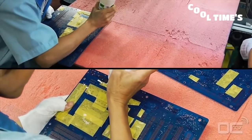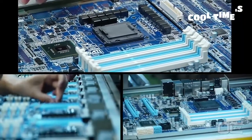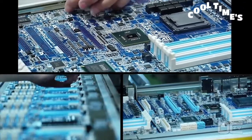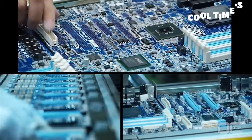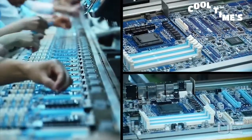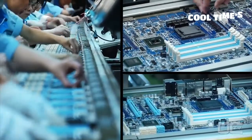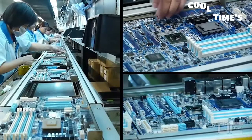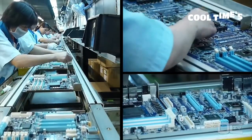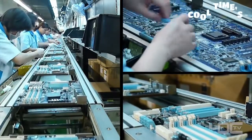The DIP stage is the second big important process when making a motherboard. First you have manual insertion. All the small components and chipsets have already been added. Now it's time to place all the other components that have pins going through the PCB. During this stage, all the components are manually inserted. You can see a long line of employees inserting the I/O connectors, power plugs, PCI Express and RAM slots, as well as the chokes and solid capacitors around the CPU socket.